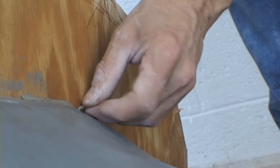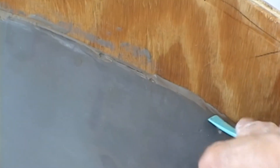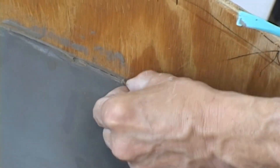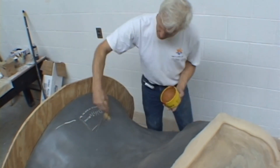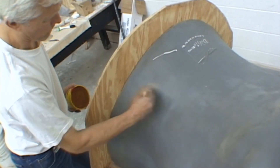Filling in any little gaps with some soft clay and smoothing it out will ensure that you have a tight model sitting perfectly within its shell. After you have cleaned the model completely, it is time to apply more wax to make sure that everything will separate carefully. It never hurts to apply a little bit of extra wax.